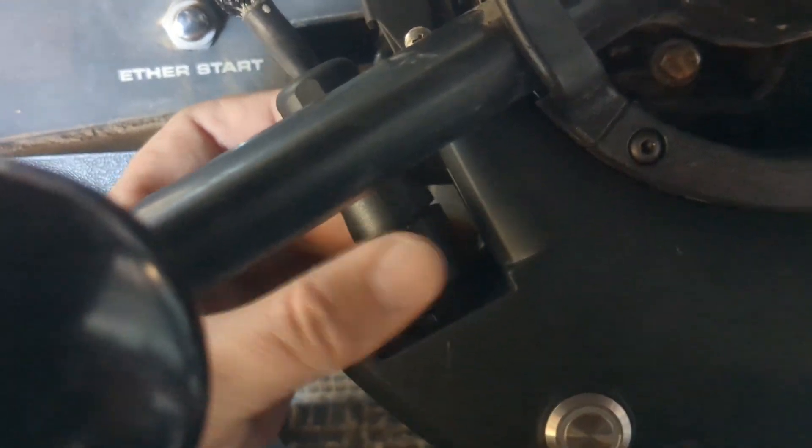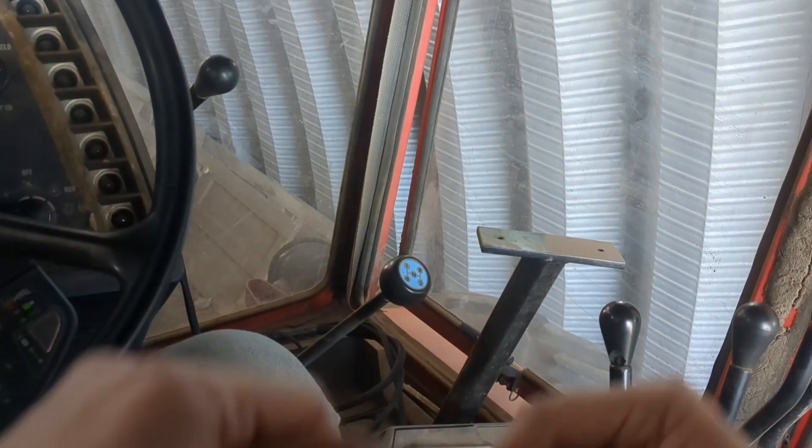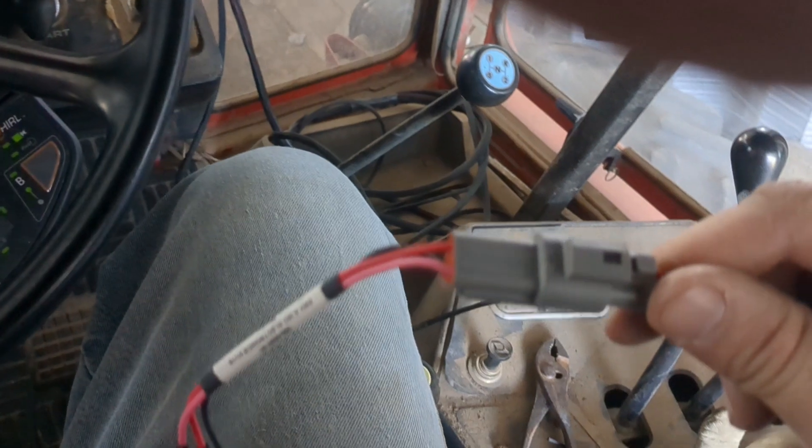This small connector is your antenna, which we just installed on the roof. They give you plenty of wire to run everything. The antenna wire goes up to the top. With these round connectors, line up the tabs and it should slide down a little, then just twist and hand-tighten — don't use any tools. For the kill switch, line up that tab, you can really only go one way, then push until it clicks. When you hear that click you know it's in.